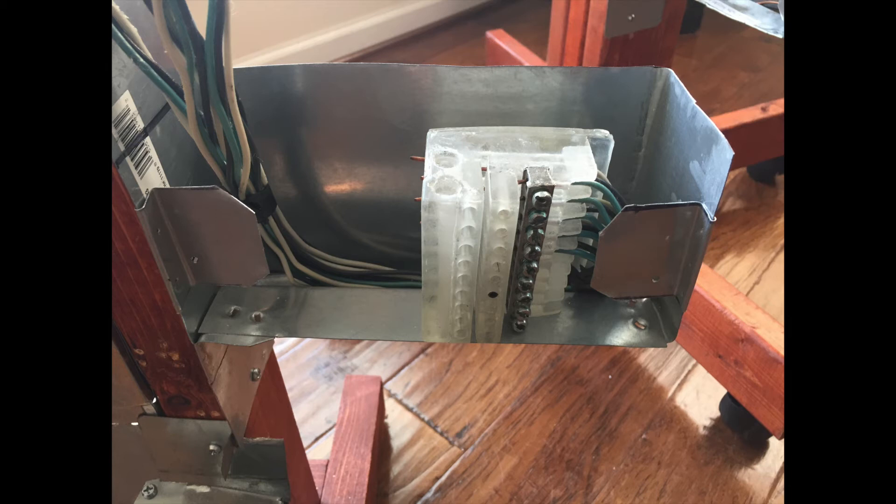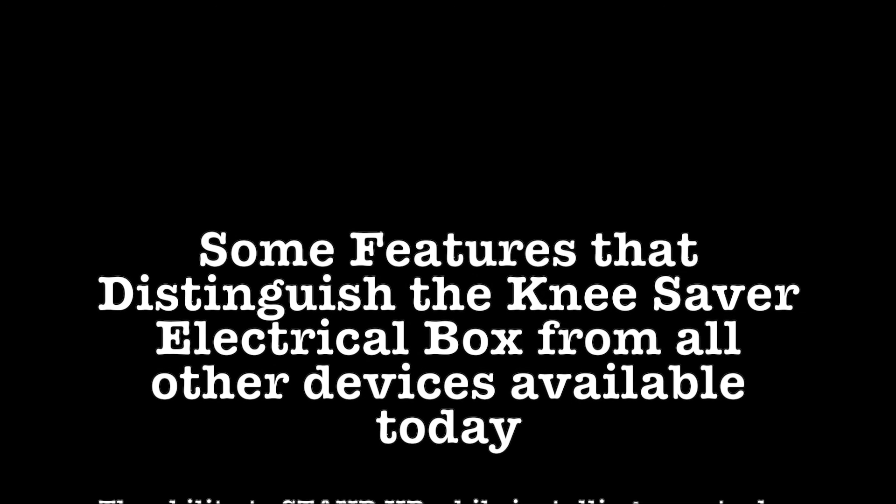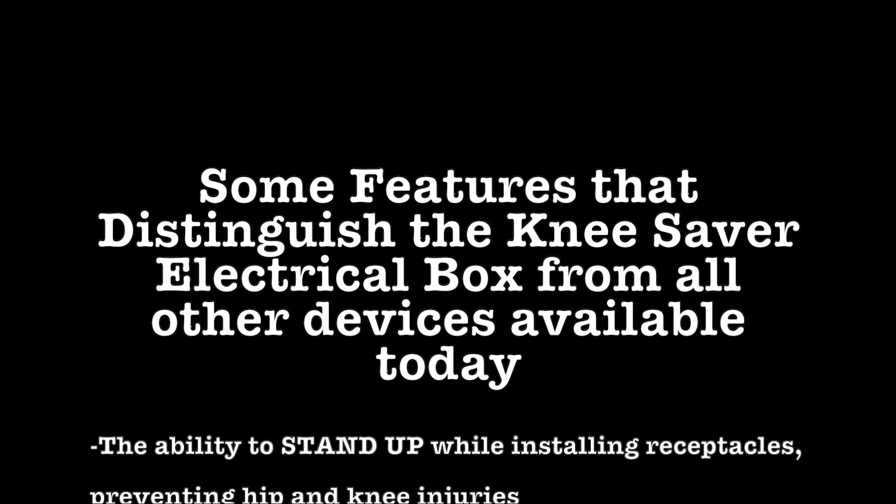This video shows the hub by itself with a termination device in front of it. If nine cables go through the top cover and all of the wires go to the open area on the left side of the junction box and become a wiring harness, that wiring harness will use an added, specifically designed trench in the bottom of the junction box. The trench goes along the entire length of the box. The harness should have a thickness of about half an inch, which will only fill up 25% of the trench. Keep in mind that number 14 wire requires 2.0 cubic inches in the box, number 12 wire requires 2.25 cubic inches, and four ground wires add an additional 2.0 or 2.25 cubic inches. The trench adds cubic inches to the box.